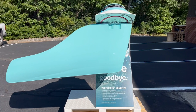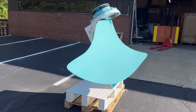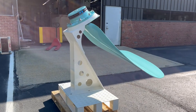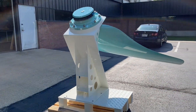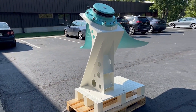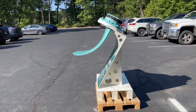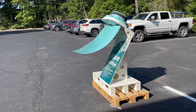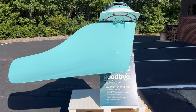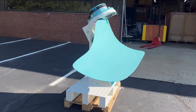This is a video of the boat show display in IMTRA's back parking lot. The display has a more aggressive hull deadrise angle than most boats, but you can see how the aggressive curve of the third generation vector fin will direct the stabilizing force much more vertically than the top section of the fin. The stabilizing force of the top section is like that of an entire conventional flat fin, which is more outward than upward. The more vertical the force direction, the better. You can also appreciate how the fins slice through the water for a smoother, softer ride, and it takes less actuator energy to slice through the water than conventional flat fins.